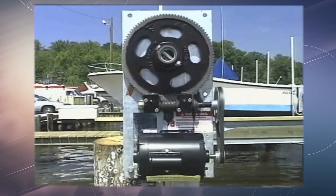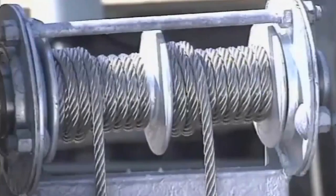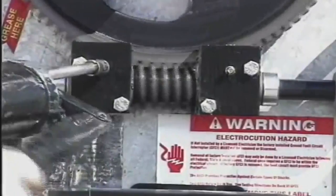First, take the gear and check the date on the plate and motor and match it against the warranty. Ask the customer for a service record for the unit. Warranties depend on annual professional inspection. At this point, you can inform the customer if the problem is under warranty or a billable service call. Be sure to check the unit for neglect such as no grease on the teeth, missing parts, or any damage to the unit in general.